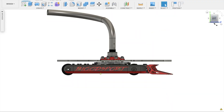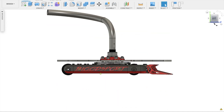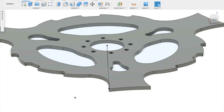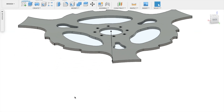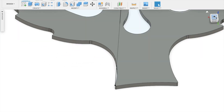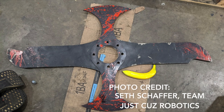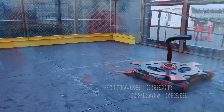To cover as much area as possible, we made the disc thinner than our other weapons at just half an inch thick. This also allowed us to have the disc laser cut from AR500 steel, cheaper and less brittle than our usual S7 tool steel. To help us dig into armor and cut through exposed wheels, we went with a positive rake angle on the teeth. AR500 isn't quite as hard as S7, and last year's bar already had some tooth wear problems, so we didn't make the teeth quite as aggressive this time. It should still bite pretty well, though.